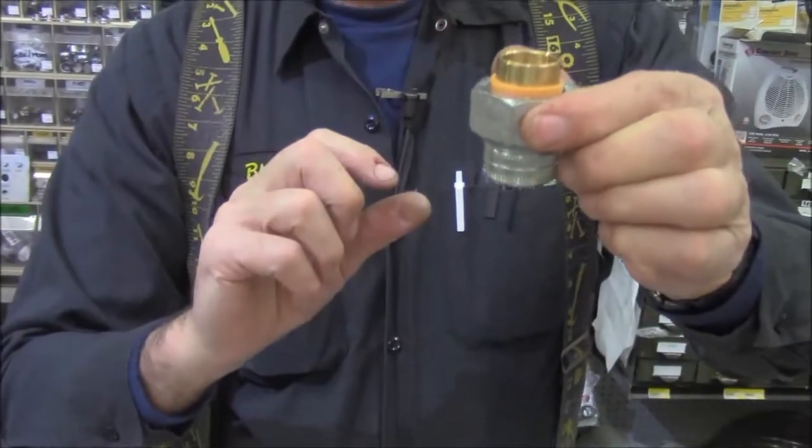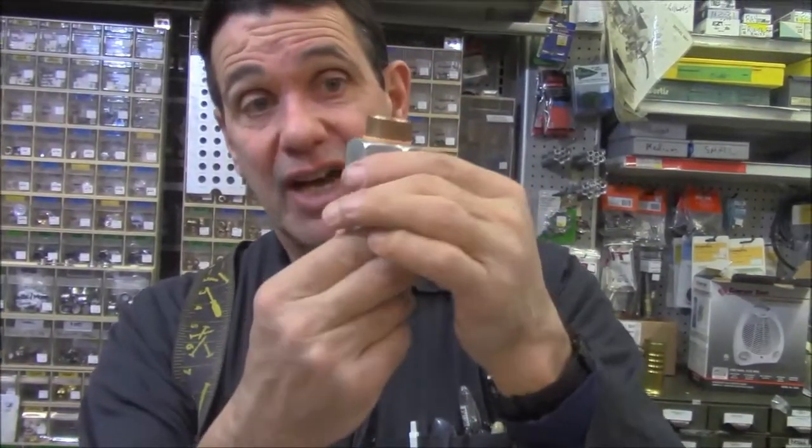If we take a meter right now, there's no flow of electricity between these two metals that do conduct electricity. So when we use this on top of a hot water tank, we're electrically isolating our hot water tank from our copper plumbing. This is of interest only to those of you that have copper plumbing. The dielectric unions come in a female connector, because a lot of tanks come with a nipple, or a male connector in case the hot water tank has no nipples sticking out of it.